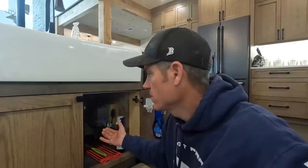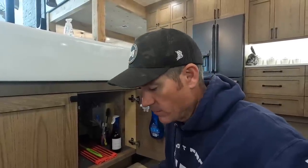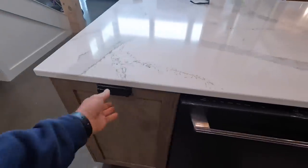When it comes to the wiring and circuits, I ran four circuits to the island: one for each dishwasher, one for the garbage disposal, and one for the 20-amp outlets. It doesn't hurt to pull extra wire — we have conduit so we could always pull more later, but it's easier to pull them all at once. Make sure you pull enough circuits so if you want to add something you always have it available in that junction box. In most places you're going to need a dedicated 20-amp circuit for the island outlets, a dedicated circuit for the garbage disposal, and I ran each dishwasher on its own circuit.